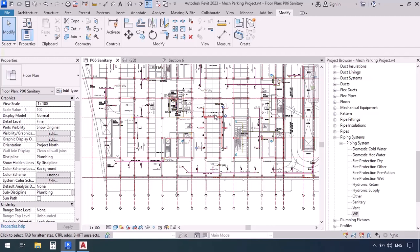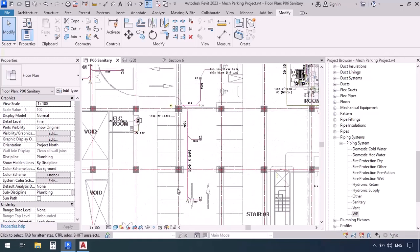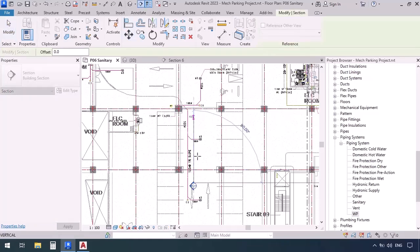Now as a next step, I'm going to select another part of this area to model — for example this line right here. It makes no difference where you start from, but it is best to find the farthest area drain from the riser because that farthest drain determines your elevations. So now we're going to start drawing from here, and I'll create a section to find the proper elevation — section, click and click.